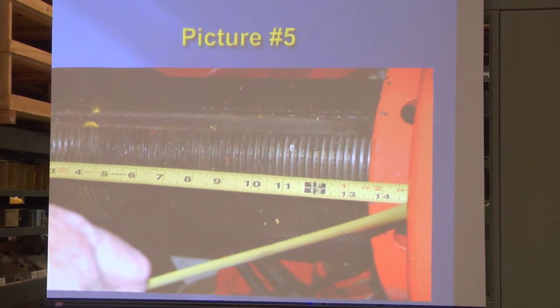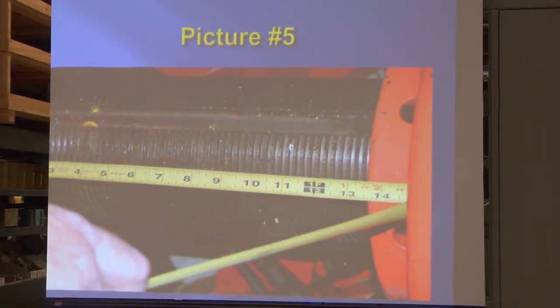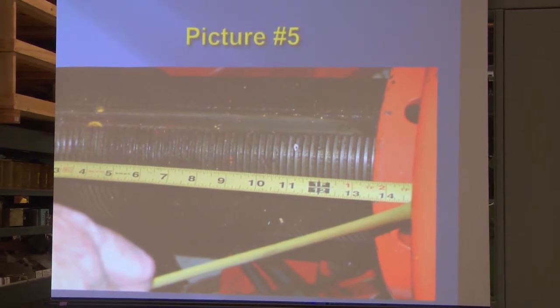They measured the stroke. Whatever that is, that's a 13 and a half inch stroke. So that sheave, from the center of the restoring shaft to where the cable lies, should be around 13 and a half, and it gives you a little bit of room on each side, and that's where, if any eccentrics need to be done, they can be done. Now, when they make the stroke longer, you won't have any eccentrics. You'll have to take what you get on the dial.